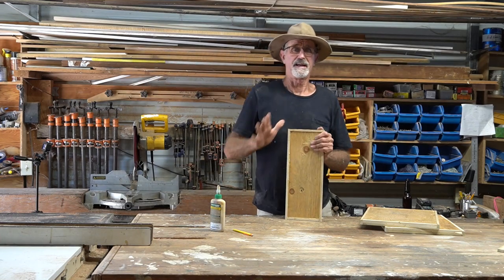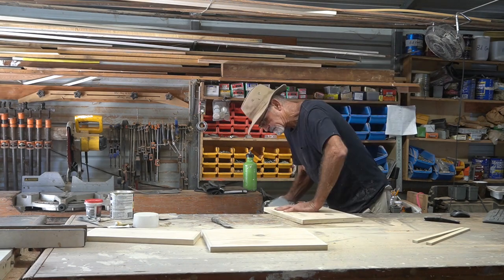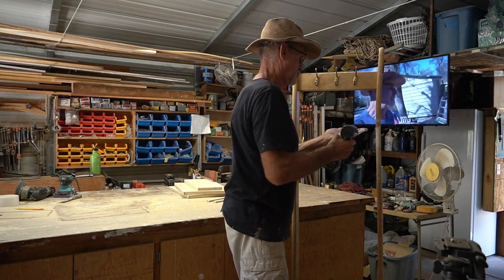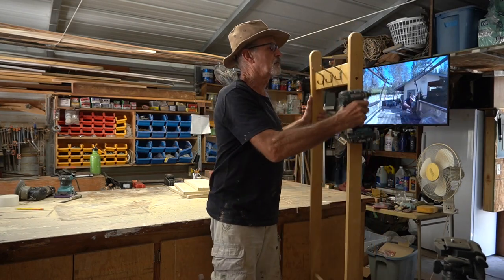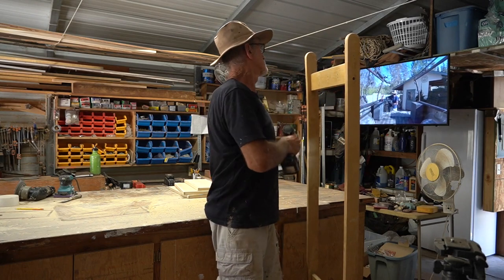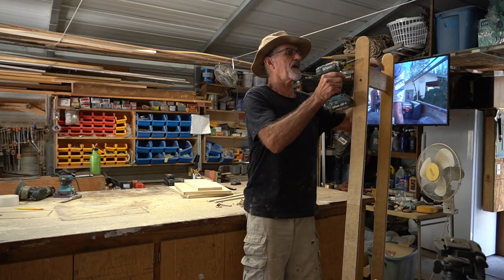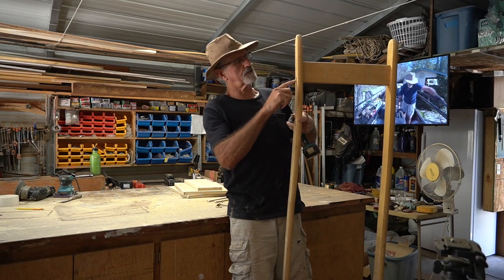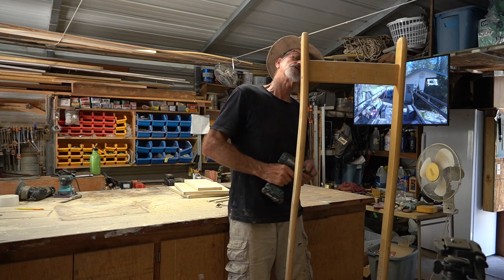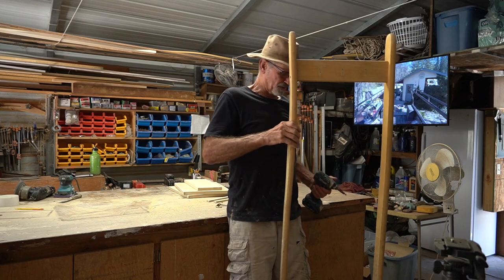There we go — all three of them with the edging on. Ideally I'd like to cut it exactly flush, but I don't want to cut into the end piece at all, so I might leave them slightly long and sand it off really easy later. Those are tiny little screws. It's kind of rickety, so I think what I'm going to do is add a screw on top, because this existing screw is located right near the bottom edge of the cross piece. Adding another screw up here should help strengthen it so it's not quite so floppy.